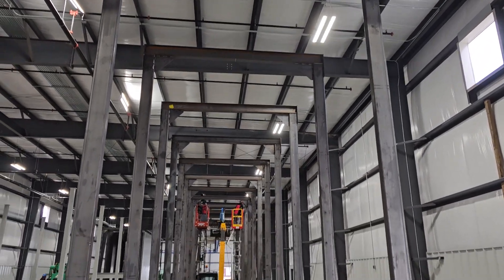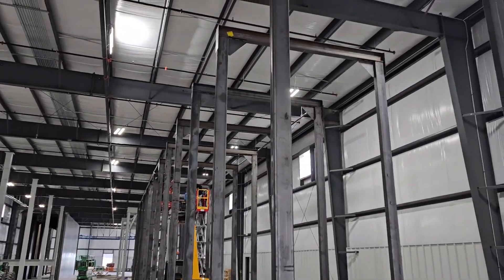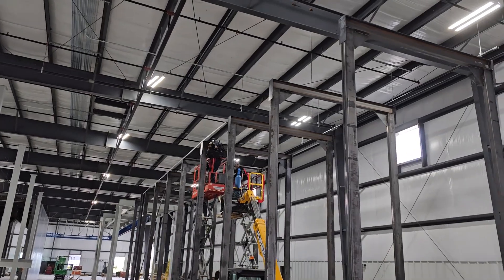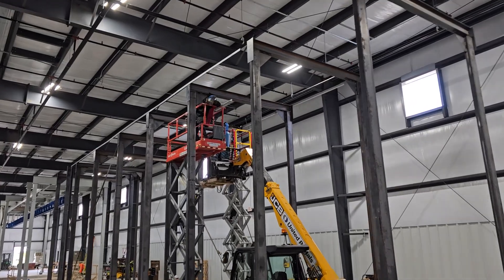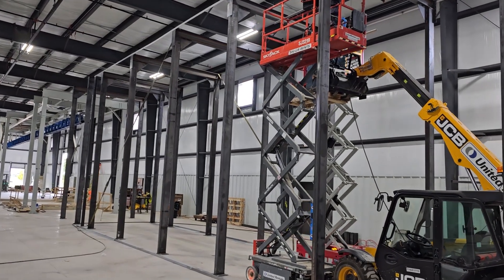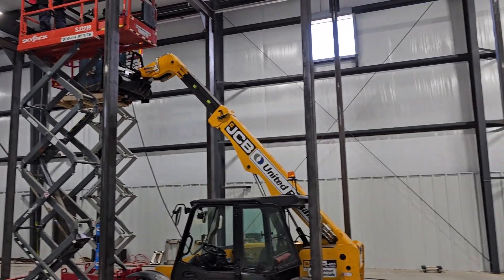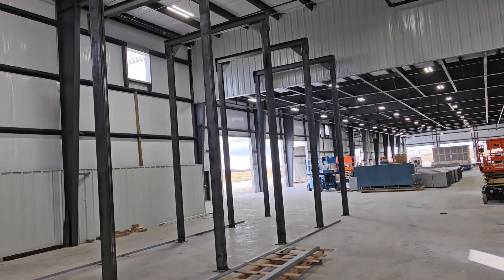That was our developments — pretty much more of the same. Right now we're putting in the top angle before we can hang wall panels. There's a little two-by-two top angle that goes in there. You can see them up there tack welding that in. This is the time they square all the columns up on top — that's why you see those ratchet tie-downs running diagonally, to rack the whole assembly and get it square. Otherwise our roof panels don't fit right. You're just building a giant box.